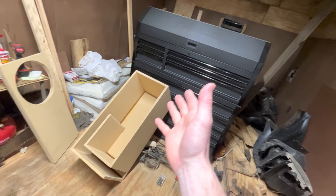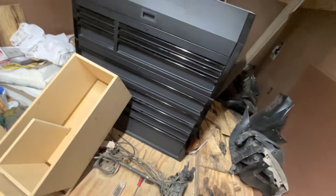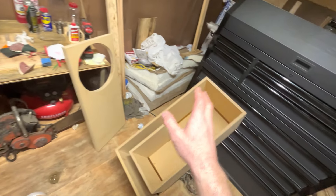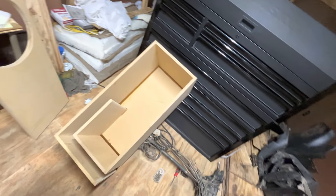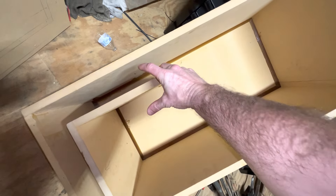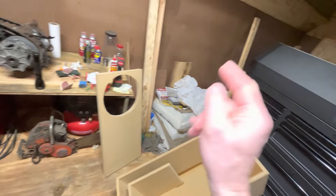Already with the wood glue it's pretty stout, and no I haven't finished with the screw job yet - I just got three in on each side for now, that's just temporary. I'm going to go back and add more screws in between. I got the top piece marked out where to drill my holes - my starter holes for the screws - because with MDF if you just screw straight in against the grain it'll just spread and lose all gripping properties. Pre-drilling works out perfectly.